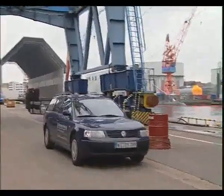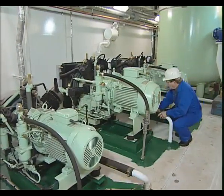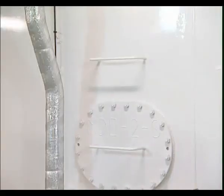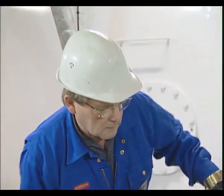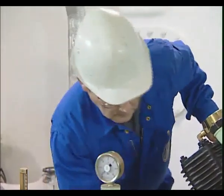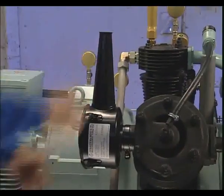Only authorized persons are permitted to install and commission Sauer compressors and to operate them. Before switching on, firstly check the compressor condition for leaks, joint tightness, etc., and all tools and loose parts have been removed from the machine. During operation of the compressor, the suction intake, as can be seen by the marker, has to be directed upwards.